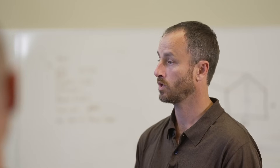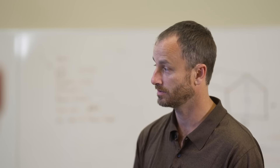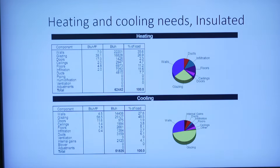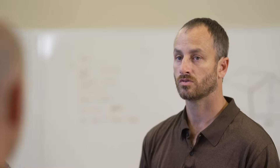What if we work on insulating? Well, currently there's no insulation. We'll definitely be able to get the back side of the house and potentially the front side of the house. So if we insulate the back half of the house, it drops about 20% off of the system needs — that's about five tons of heating and drops it down to about four and a half tons of cooling.